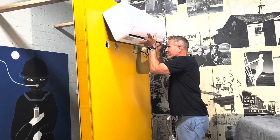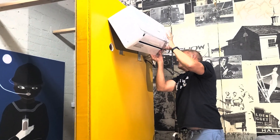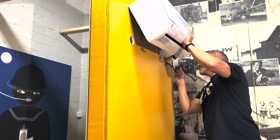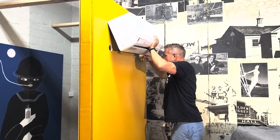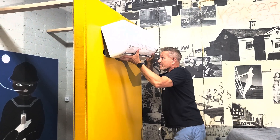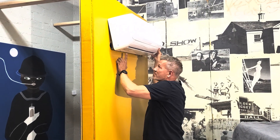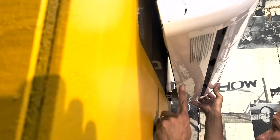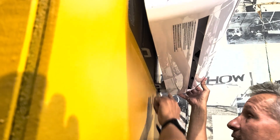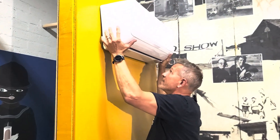If I can hang it — that brings up a good point. We can theoretically get this on the tabs. The condensate hose is on the bottom. You'll see some little triangles here — those should be right at the center of your tabs. They not only help line up things, but if you ever want to release the indoor unit off the wall, push on those and the bottom clip tabs will release.